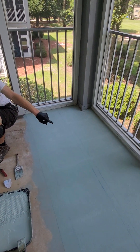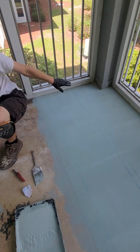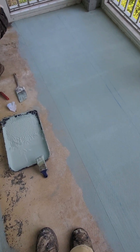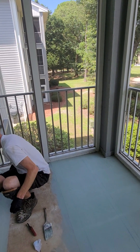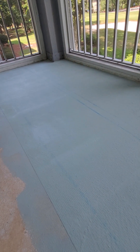So we're going to put another coat over two-thirds of this piece before we start the last section. We're going to roll that again — at least three layers on it now. We want three layers because we've got our base, our fabric with our top coat, our top base, and then we're going to do another base over top of our fabric base coat guys, so we have three layers. Now some people would say, 'Oh, why don't you just throw it on and trowel it flat' — you don't want to do that guys. That's not where your strength comes from. It comes from the oxidized surface layer. When you have three series of layers — real layers, not just one thick coat — that's where you get your strength and durability. It's in the stages of the coats. The oxidized layer is where you get your strength.